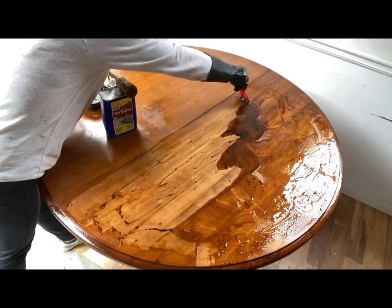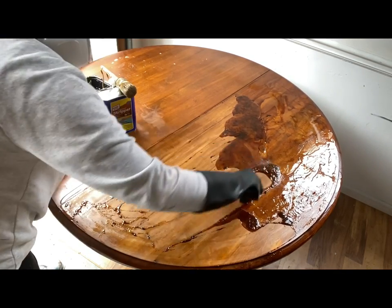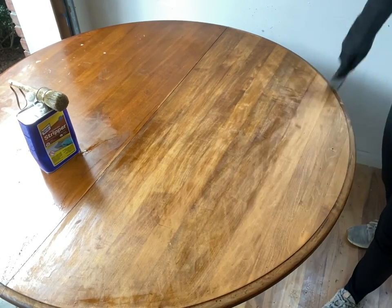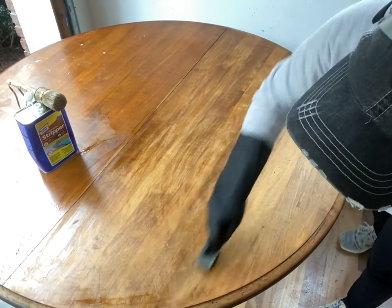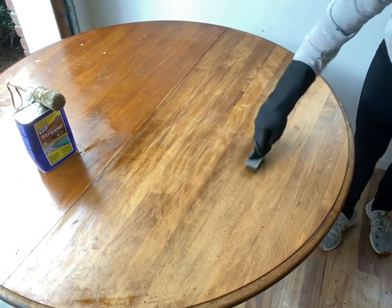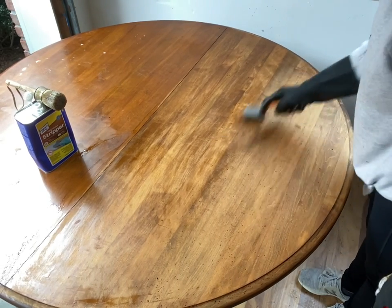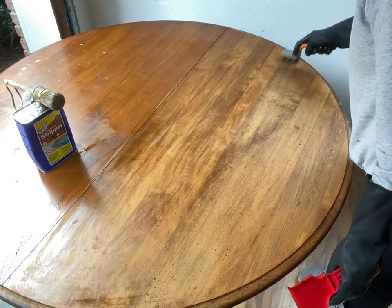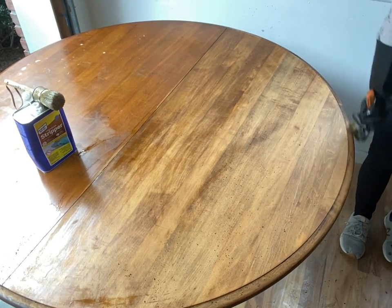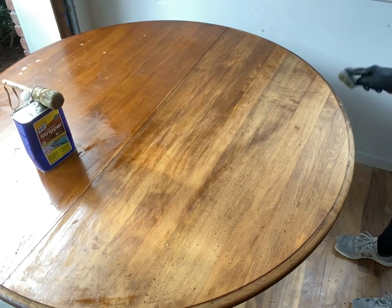With those heavily dinged pieces I typically just paint them as-is rather than filling in all the factory damage. You can wax over the nooks and crannies — a brown wax looks nice and gives a rustic vibe while still updating the color. If you want to stain, you'd need a stainable filler, but with a lot of dings you'll notice them on a tabletop. I also have a Pottery Barn-style finish on my channel using paint, stain, and glaze that might be a good option if your table has those dings, or you could find a smoother table like this one.